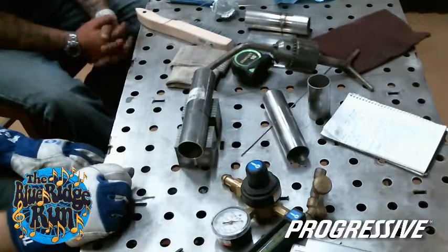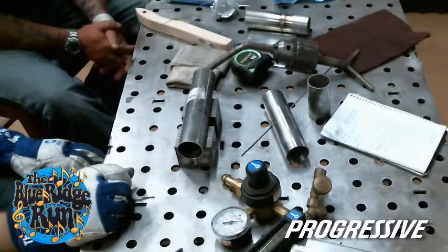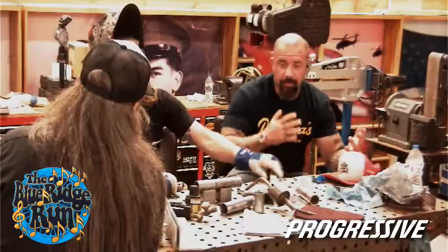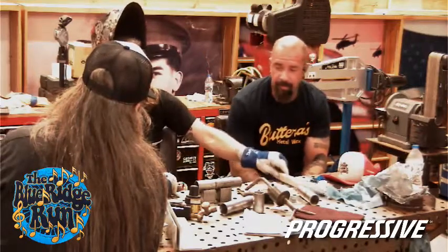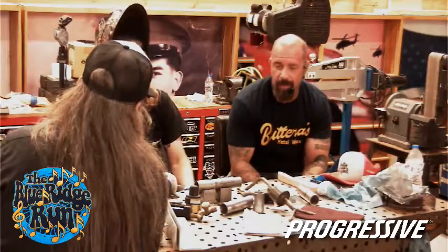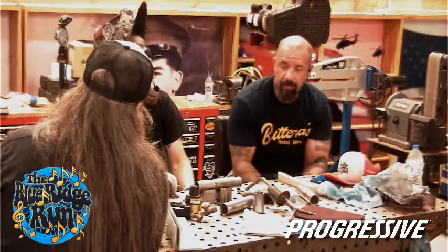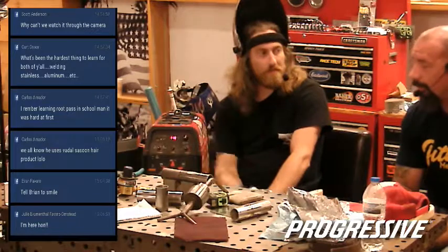I think a big thing with that is if you're using grinding pads or specific pads you like for your metal prep, make sure to keep them separate from stainless and aluminum and steel. It goes for everything. Cross-contamination is a problem in shops, and stuff that shouldn't rust starts rusting. Anything that's on those pads, you think you're cleaning the metal and you're just putting all kinds of junk into it. Now that's embedded and it's been heated up and you're never getting it out.